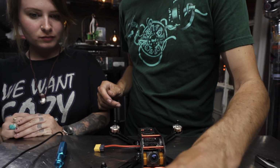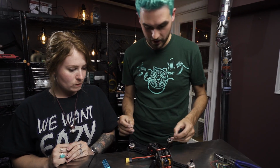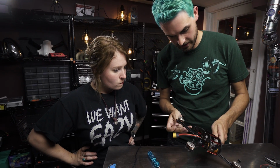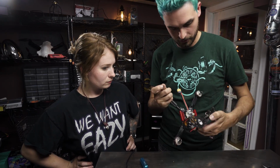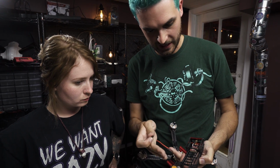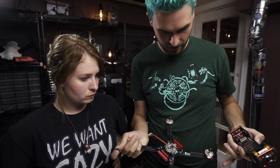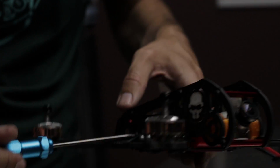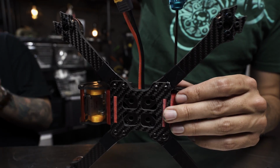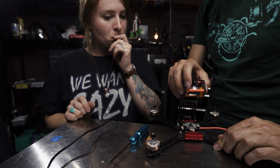So I think the best thing to do to ensure that you have all the slack that you're going to need for future repairs is actually bolt it up and then hinge it open and assemble, because we've got the video transmitter and the camera mounted to the top plate. We just need to connect the wires. So I think to be sure that we're going to have enough slack in the wires, let's attach it to the rear there. Got it hinged on the rear, so we'll have to slide this back off the end here so we can open it up.